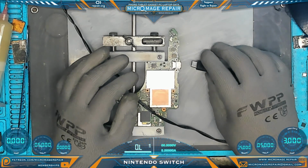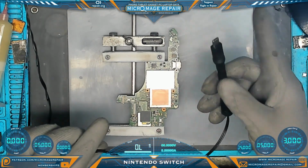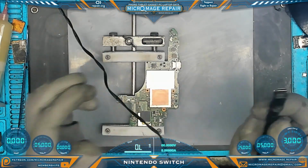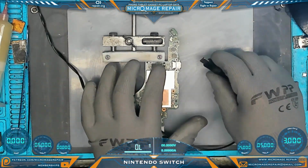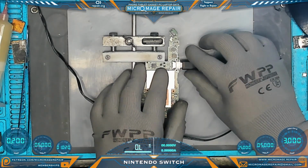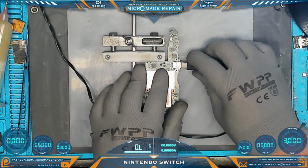We're ready to begin some power testing. We'll begin with our PSU dongle. This is a USB-C to 3.5mm adapter that we have hooked up to our benchtop PSU. What I want to see here is a quick jump in amperage and back down with no hanging. Like so. We want to see that on both sides ideally.